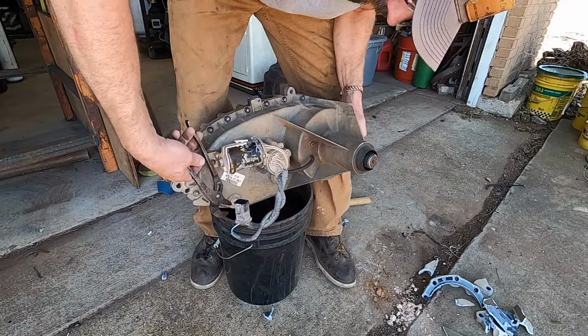I was gonna go ahead and heat treat this little blade, what's left of our efforts so far on this project, but there's just some inclusions that are too deep, so there's not gonna be enough steel left once we get them all the way out. And I really think that's due to the fact that I started with an extremely porous billet, you know, and I thought I could get all those voids out just forging that down, and maybe in theory you could, but it would require more forging. So I'm gonna grind this a little finer here and put it in some acid, some ferric chloride, and see what the pattern looks like.